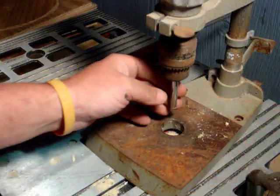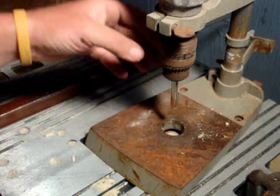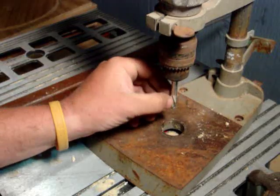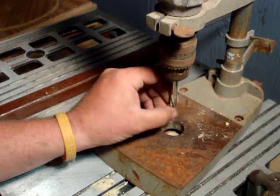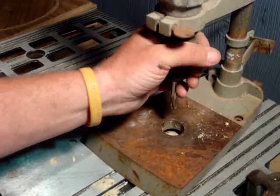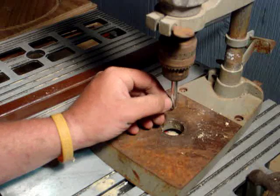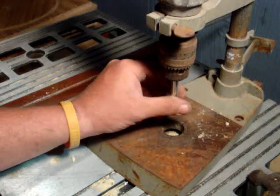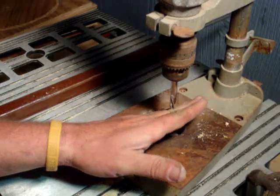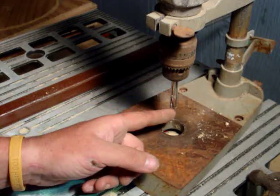Hello, I'm Scott Brown with Green Wind and Other Home Energies. As you can see right here, this is a piece of that rod you saw before and I'm going to turn this and show you what I've done. I went ahead and ground down the side, leaving about a 90-degree angle. I should have had the curve going the other way since it rotates that direction, but backwards works fine — this drill doesn't go in reverse anyway. The other drill bit was just a little bit thinner than I wanted. I stuck the rod inside, took my angle grinder at an angle, and held it there until I got a nice point, then ground down carefully to make it go right to the tip.